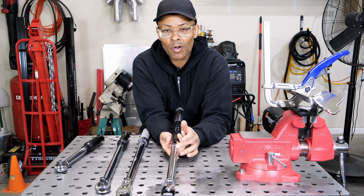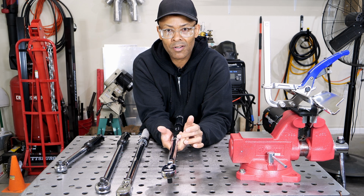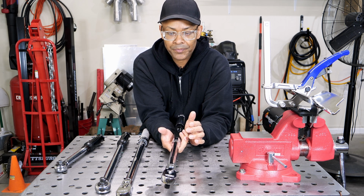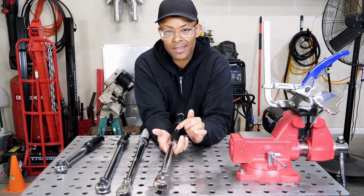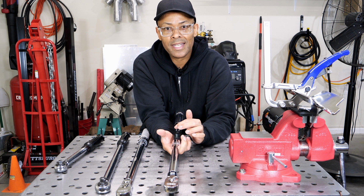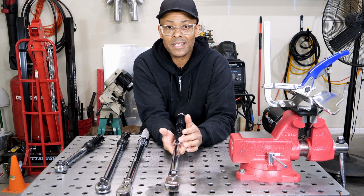And if you go over by 125%, I believe, or something like that, it's going to let you know. And then if it's 150%, then you're going to have to service it. It's going to say damage. Now, that's a really nice feature that I like, and it's going to be in the over info. There's a little setting here that says over info, and that's where you'll see all the times you've gone over the maximum torque value with your wrench. So it's something to keep in mind.